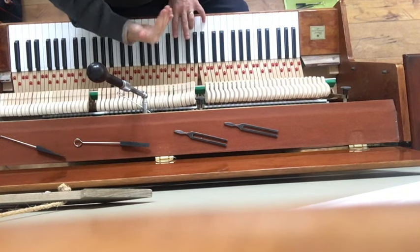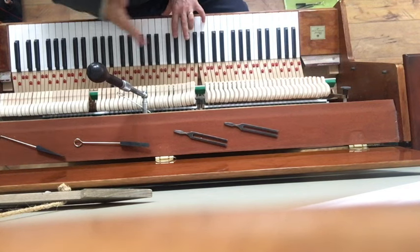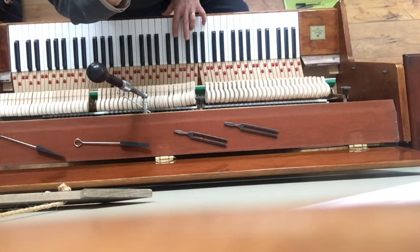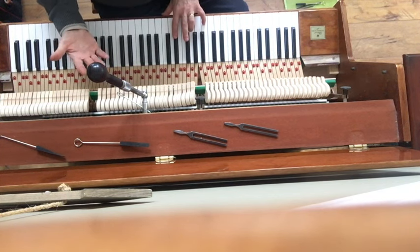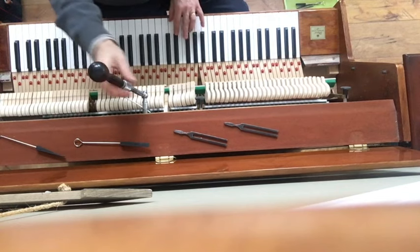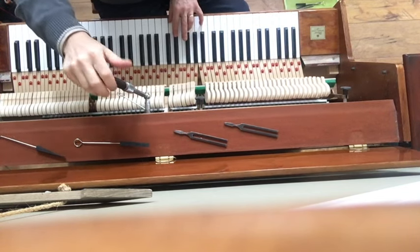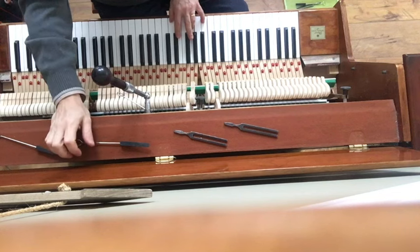By the way, the first step here is to play the slow and the fast to confirm there's a window there. Every step along the way, we're going to be using an already tuned slow and fast interval. And if there's no window, in fact, like if it's a slow and a slow, then we've got to correct something. Something's drifted. That's how accurate this is. This is called the self-correcting feature. Still not slow enough.